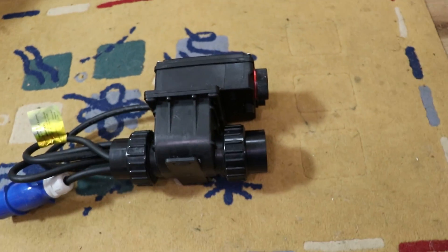The cheap little heaters, I'm quite happy with this one. So I've ended up buying the 1kW version for this tank. I could have used the 2kW one on here but that is well too much. Even the 1kW is too much for this tank - it just doesn't get that cold. If you really oversize your heater, what you'll end up doing is just increasing your pond's temperature by a couple of degrees in a really short period of time before your heater even realises and then turns back off again. And then your heater's got to wait until the temperature drops, so you'll have big fluctuations in temperature. So it's best not to oversize the heater too much.